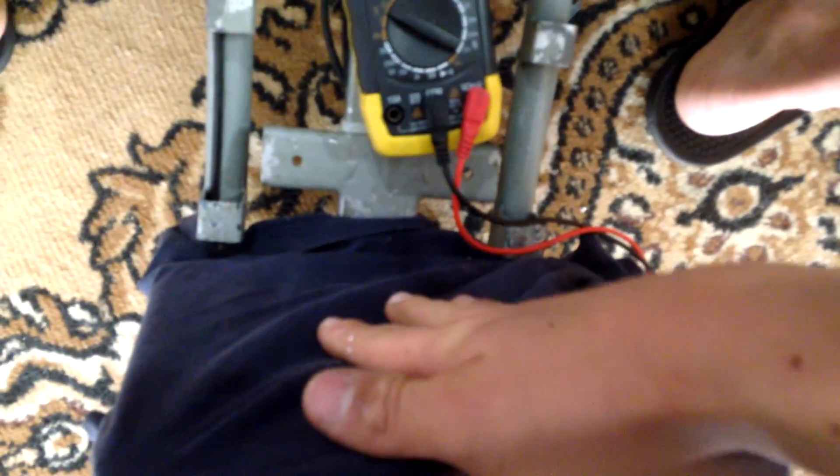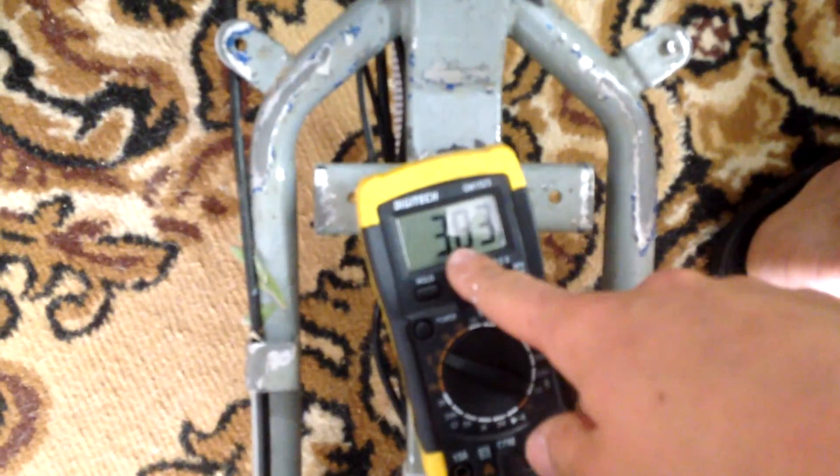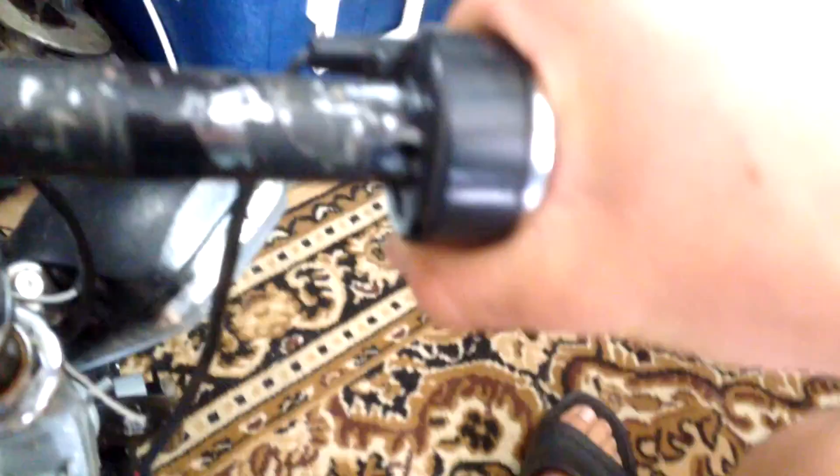Confirming the voltage now — it's about 3.83V, kind of like a lithium cell the way it's wired up. I've got the battery hooked up to my electric bike. This is the main battery with the new pack in series — it used to be 40 volts fully charged, and now it's about 44 volts with the addition of this battery pack. I'll put a bit of a load on it by twisting the throttle.